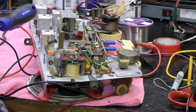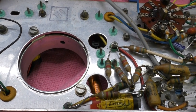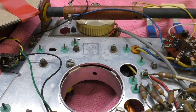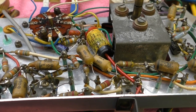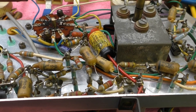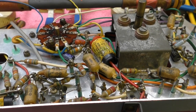As I'm recapping, I'm just checking it still works. Wretched transistors - should have stuck to valves, much more reliable! In the end I took the loudspeaker off in order to get at this electrolytic, which is a bypass for the audio driver. This bypass capacitor - I've replaced it here. It was very leaky indeed. The supply voltage is decoupled through a 470 ohm resistor and decoupled by this capacitor. It was sitting at 3.31 volts; now since I've replaced this capacitor it's come up to 7.1 volts. So the receiver's a lot more lively with its RF circuits powered correctly.